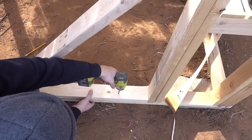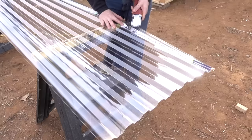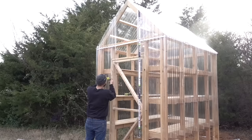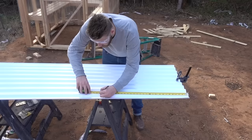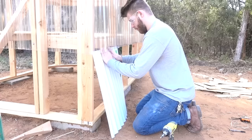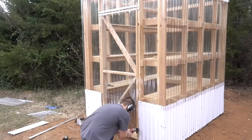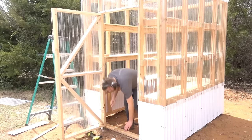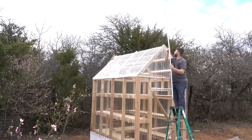I had what I think was a pretty clever idea: once my door fit and I knew it would open and close right, I screwed it closed to the frame and then installed the siding across the whole front of the greenhouse so everything would line up really well. Then I came back with an oscillating multi-tool and cut the door out. Before doing that, I installed all of my white panels on the bottom — the bottom of those panels extends past the 2x4s so I can bring dirt all the way up to that edge without the wood touching it and rotting.